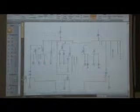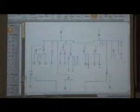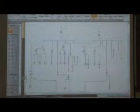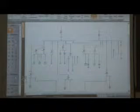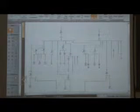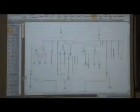So I look at that for a while, and I say, well, there's an induction, a synchronous motor there. There's a load that goes down. There's another transformer. And then you see there are a couple more transformers and some loads. Those are adjustable frequency drives. They may be a problem, I don't know. And you get over toward the middle and you see some more buses. Then you begin to see that over on the far left there's one with a tie breaker. Tie breaker means it's a little more complicated than you might wish. Well, that's the way it is.